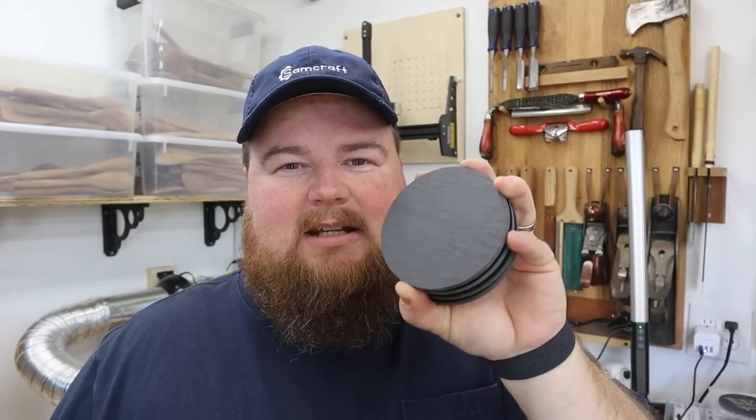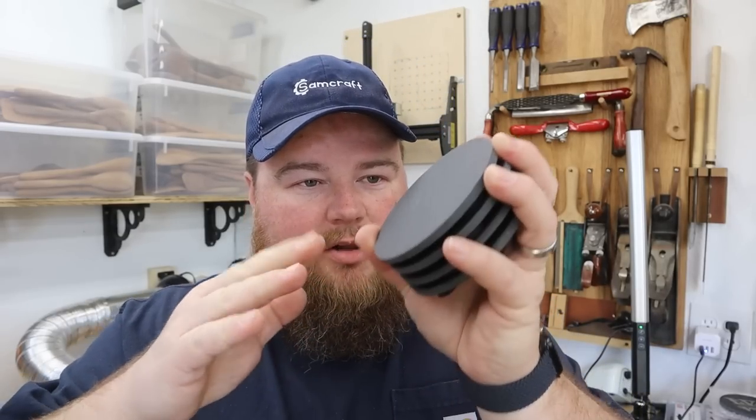All right, it's time for the pudding to hit the pan, Sam. I've got my set of 4 coasters. These are ready for a customer's order. I'm going to go ahead and plop them down on the laser. Find the tallest one of the 4, put my 3 millimeter basswood spacer, focus the laser, lock it in, and run this job. Let's see how good it turns out.